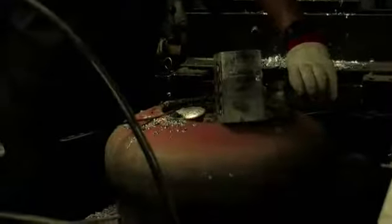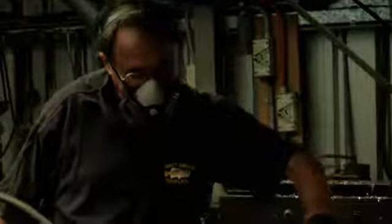It takes about 15 seconds for the lead to set after it's poured. So the hook goes into the mould, the molten lead is poured into it, and within 15 seconds it's cured. The process we're doing here is preheating the mould so that when you pour the molten lead in, the lead doesn't actually dry up. And the hooks are made so they just drop straight into a slotted groove.